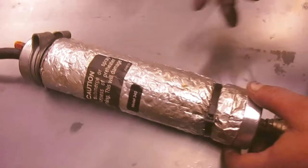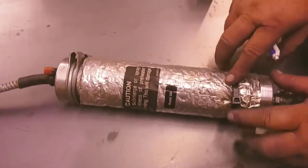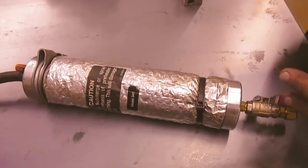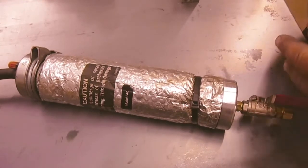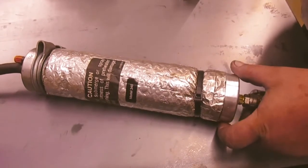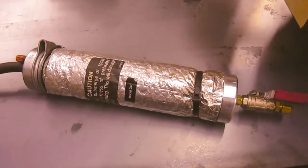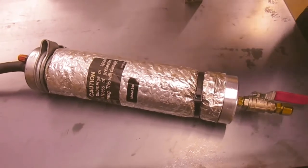On the Energy Logic and Black Gold, they have heater elements inside this big oil preheater. If the unit runs for 5 to 30 minutes and shuts off, then waits and refires and shuts off and refires in 5 to 30 minute intervals, this preheater is probably not heating properly. Give us a call — we have the parts to take care of that and can get you a replacement preheater.